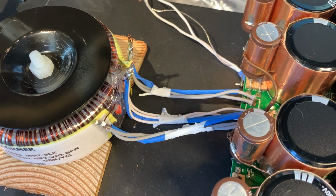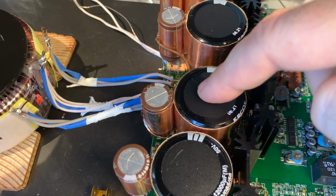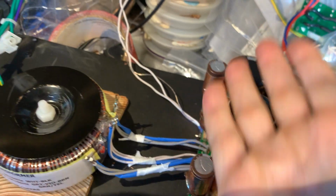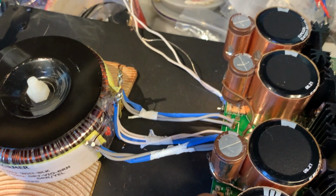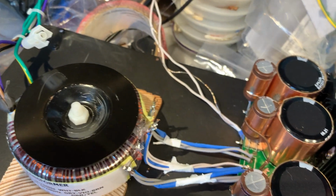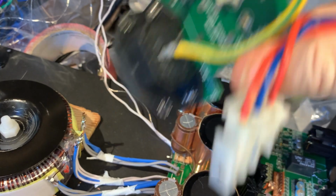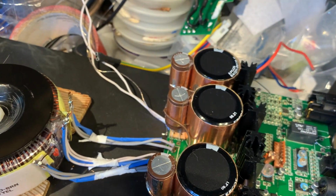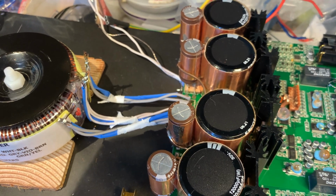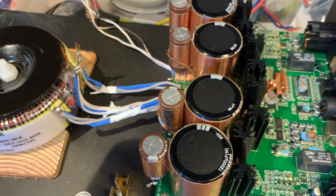So you would ask why the companies don't do that, because you see now it's not quick remove anymore. If I want to take this board out now, these are hardwired, so I have to desolder them to take it out. Or I have to flip it over and keep it here, because they won't budge. And this is the prime reason why this is a practice, because if there's a problem with the deck board, you just quickly disconnect it from here, maybe you swap in a new board, and then that's it, problem solved. But when everything is hardwired, you have to solder everything to get to it. So now a 10-minute labor becomes maybe several hours of labor, depending on how much soldering and fiddling you have to do.